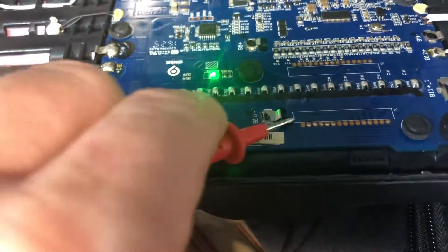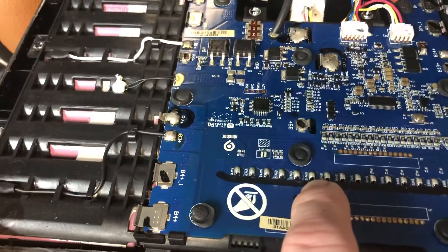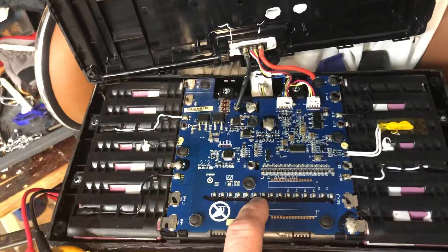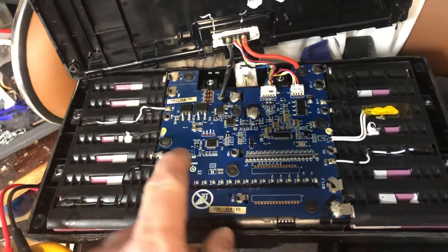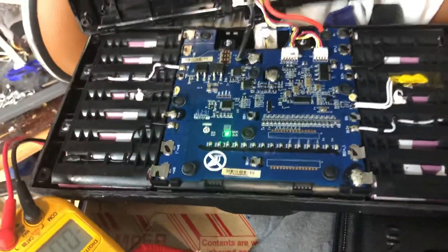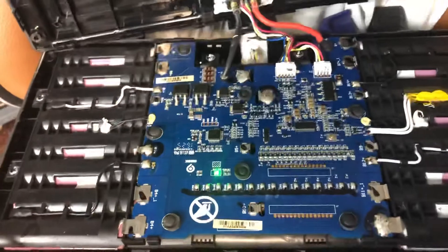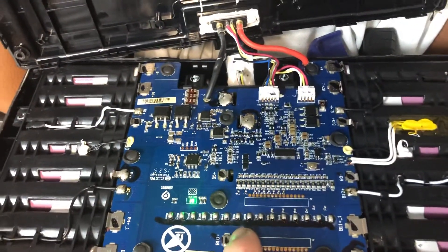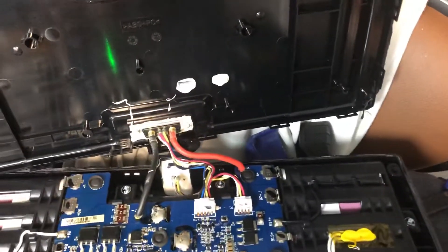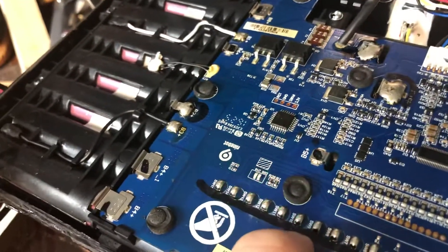Going through here, I started fiddling with these components and felt them. All of a sudden I saw that this piece right here was moving. So this is the problem — this is going to fix the battery pack. I'm pushing it down again and it goes back to blinking green. I'm willing to bet my paycheck that when I solder this back and put this battery back together, it will charge and work like it did before. All the cells tested good, there were no dead cells. I didn't see anything burnt. Lo and behold, that piece of metal coming up from underneath to touch the board — the solder joint is broken, so it's not getting good contact. When it does get good contact, boom, voila.